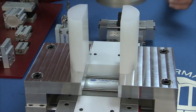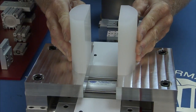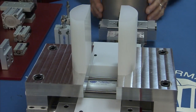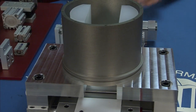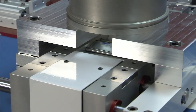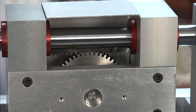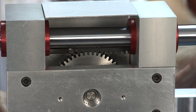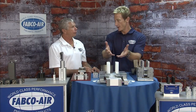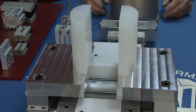The neatest thing is the Mac Daddy — the LTG. This thing will go up to 21 inches of stroke. So let's say you had a machining operation where you had a 12-inch part and a 20-inch part — you can put one gripper on your robot and it'll grip all of the different parts. You get that because of how long the stroke is, like a wheel manufacturer for instance. It's got four racks and two pinions.